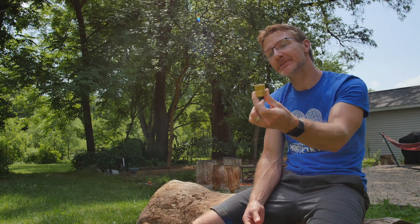First, we'll go through some of the most important parts and assemble them loosely so you can get an idea of how they go together. The first part is this brass hose adapter. This is hose threads on one end and regular three-quarter inch threads on the other end — because for some reason they're different and you can't just thread three-quarter inch threads onto a hose or hose bib. So this is what your hose would run to, or you could put it directly on a hose bib or faucet.